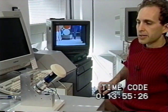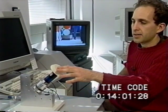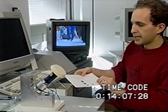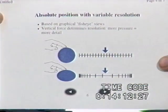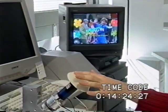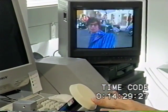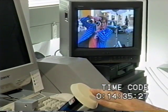This is an invention which we call haptic fisheye views. It's a way of continuously varying the resolution of a haptic display based on applied force — in this case, your applied force against this wheel. When you press lightly, there's finer spacing between ticks; when you press hard, there's more space between individual ticks. Pressing lightly, I can advance very rapidly through a videotape and what I'm feeling is a very fine texture. When I start to press with more force, that texture resolves into a series of discrete bumps, so I can advance frame by frame through the video.